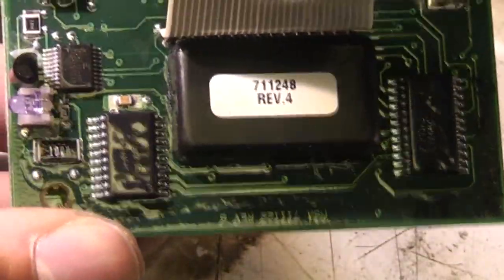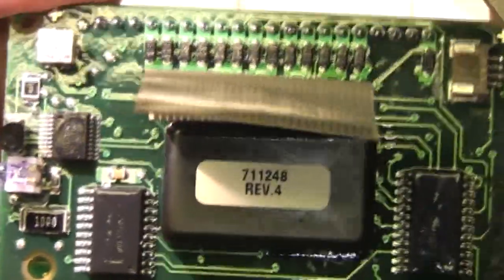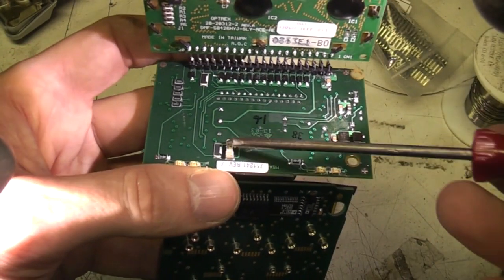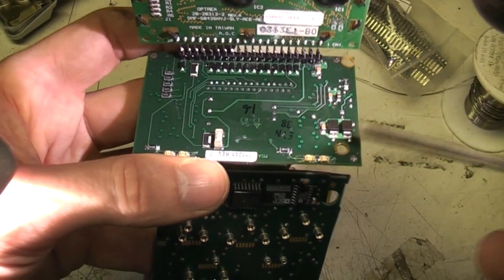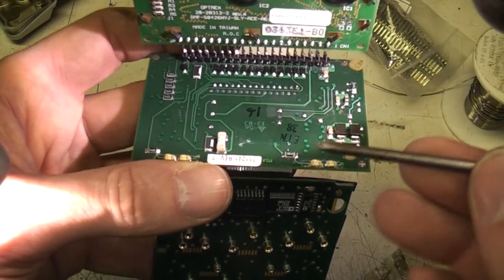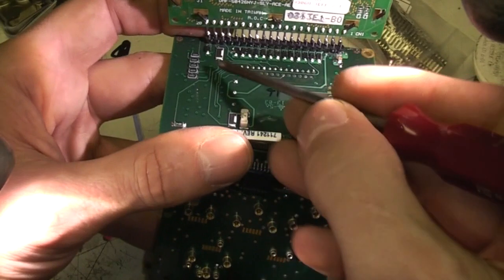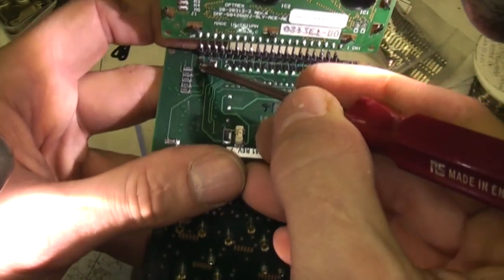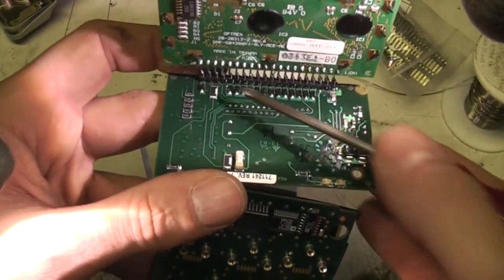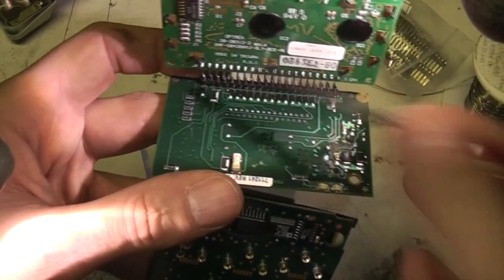I'm guessing this box here is a DC-to-DC converter to produce the LCD supply, and this is probably in its own little potted enclosure. Because there are sometimes cases where you have to put a high current through an inductor higher than the spec allows, so the only way to make that safe is to put it into a potted enclosure. Because it's potted you can't get explosive gas inside to explode, and the protection means that by the time it gets to the pins on the outside it's no longer hazardous. So in some intrinsic safety equipment you'll find quite a lot of little potted assemblies — it's actually quite an easy way to ensure safety. On the back of this display board again you've got another fuse, more big resistors, more protection diodes. A lot of this is to protect the high voltage coming out of that DC-to-DC converter.